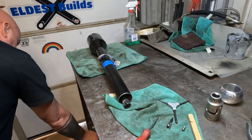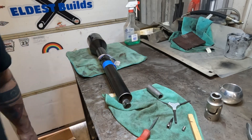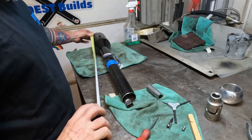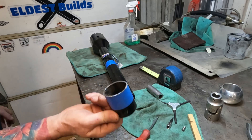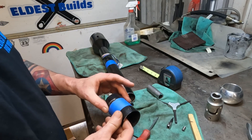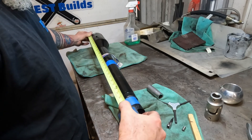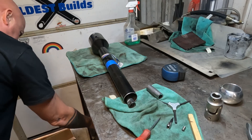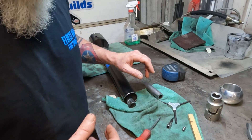I took the original, cut the end off, and then welded them back together. So we started with a 30-inch column and now we're at 25 inches to the end of the column and 26 inches to the end of the shaft. I had to cut this off — I think I even cut some more off. Originally we were 30 inches to the end of the shaft, and now we're at 26. Let me clean up on this a little bit, smooth it out, and then we'll see what happens.